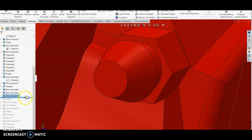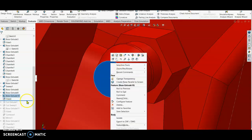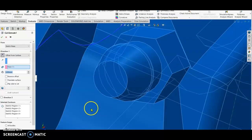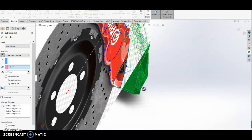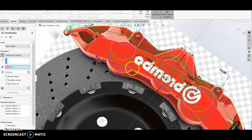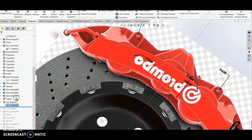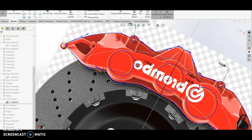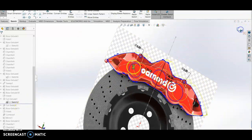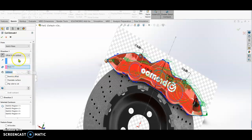So after that, I peel it, okay, and then I sketch here, sketch on the base, and then I extrude cut, okay. So this is, so sketch, edit, oh, this is the extrude cut of the hole of the cylinder. All right, so we use the original circle, okay, meaning to do that, I close first, okay, so that you know this extrude cut. So we edit sketch, so the sketch is from the original circle on the original drawing, okay. So I use this one to extrude cut, so the depth of the cut is I use up to surface, meaning offset from surface.